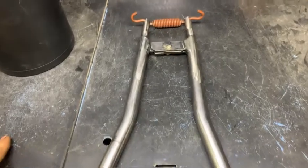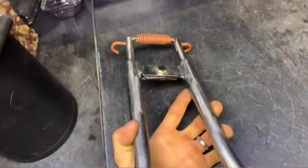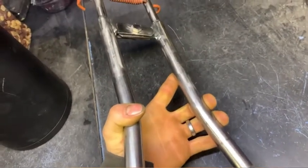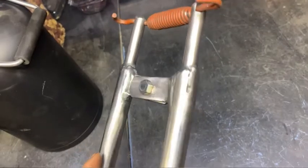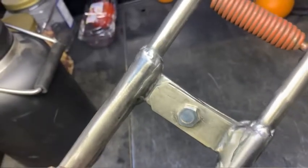I got a little carried away and neglected to record everything I probably should have, but this is where we're at. This is the first stage of the tool. The handles are extra long so you can grab it with two hands. I welded those two pieces of the tire iron onto the hinge, took the tube, cut it in half, slotted it - basically cut a notch out of either side so I could slide it on there and weld. There's like three or four passes on that side, a couple passes on the other.